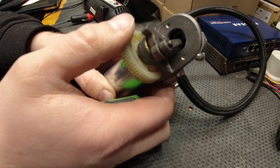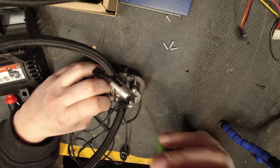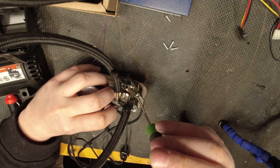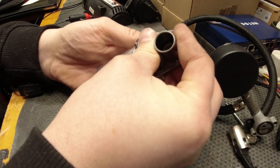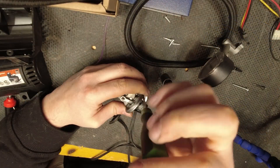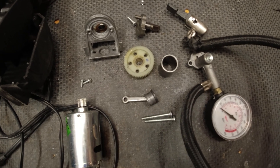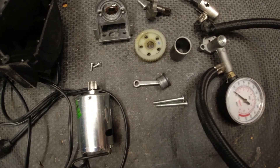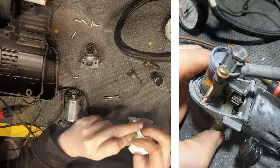At least those that are made with, let's call it, bad tolerances. It is quite a simple design where we have a DC motor that drives the piston in the cylinder via gears. As the piston moves we have a small non-return valve and pressure is created. Everything looks fine here but it was very dirty. Speaking of which, we can mention the other two that are faulty. One had the plastic gear that was worn out and only the motor was spinning, while on the other one the cylinder cracked.